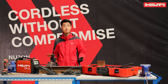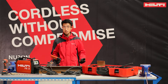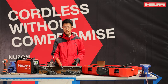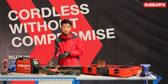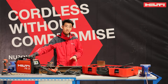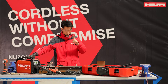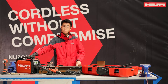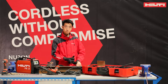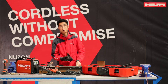As you can see, it's super uneventful — you do not see any sparks, not a lot of smoke, and even the light is super minimal. Because it's a program-controlled system, it only feeds the minimal amount of energy into the weld. Essentially I can already stick my finger near the weld without being burned, because it only feeds the minimal amount of energy to the steel — it's not too hot and you can basically touch it with your hand after the weld is done.